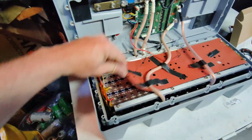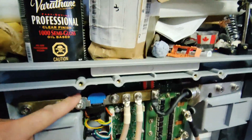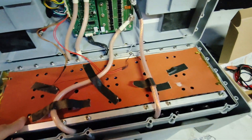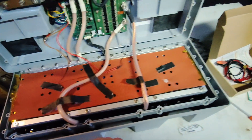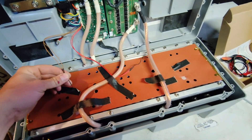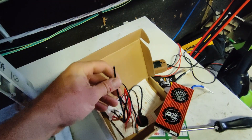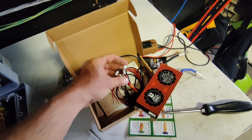We've got the battery opened up. Looking inside, it looks pretty good — doesn't look like we've got any water damage on the inside. Even though it looks like something came in a little bit near the top, maybe that's just corrosion. It may not have actually leaked through anywhere. This one looks good — no water damage, so that's a plus. I also noticed temperature sensors taped down from the main board, and the DALY BMS came with its own temperature sensor as well.